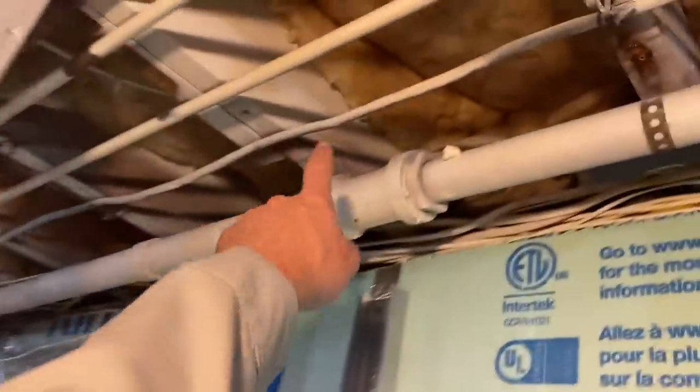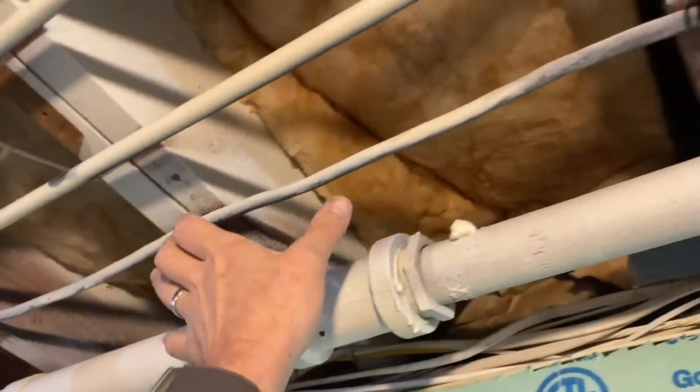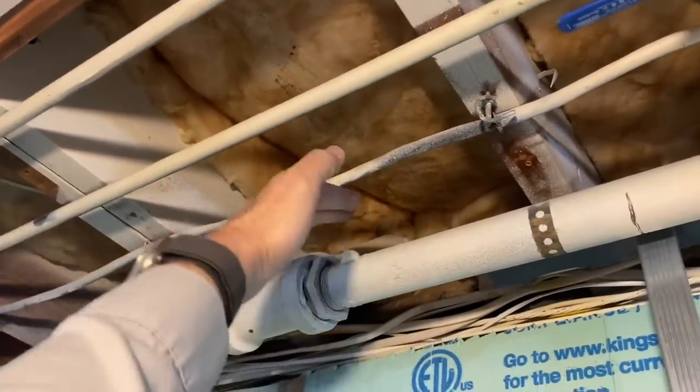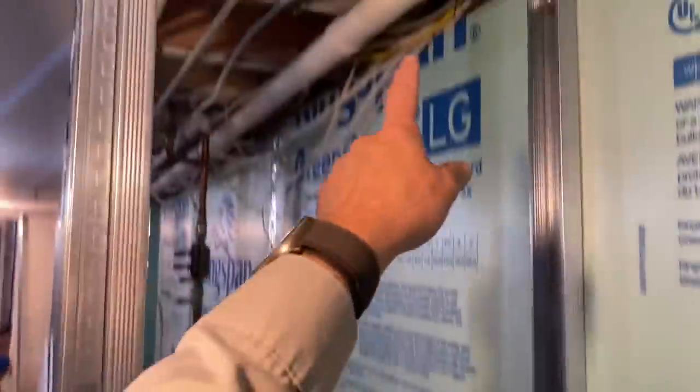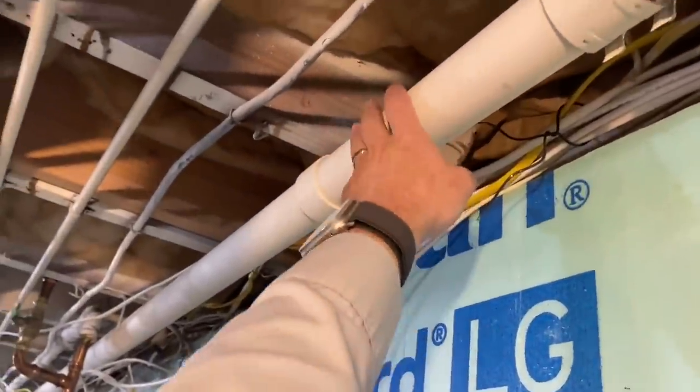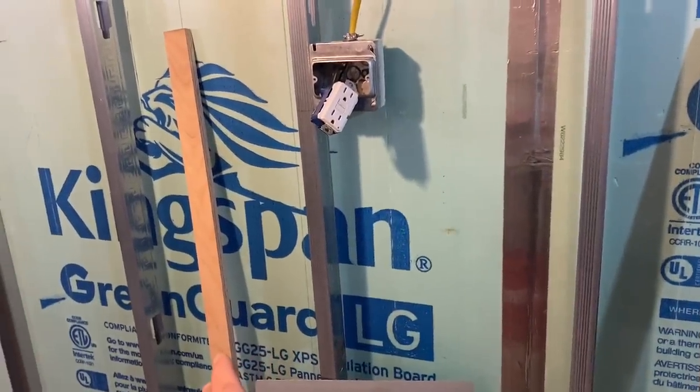It's a little bit tall on the regular one. That's gonna go right here — we're gonna cut out this potential leak right there, cut here, cut there, cut all this out and put in a new tee here, rolled, with a clean-out. Before that we'll have our pickup for the laundry pump, which we'll tie in here with another fitting. We have a washing machine box going inside the wall and that should be it.